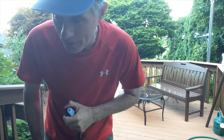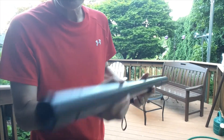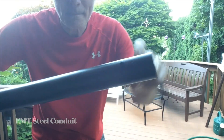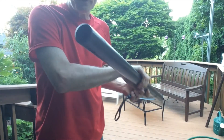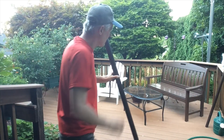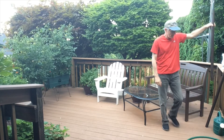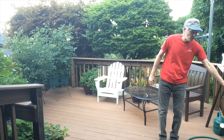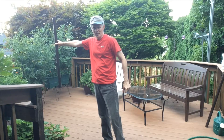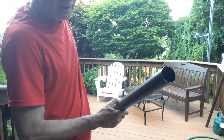After many different attempts, I decided to use this inch and a half EMT conduit. I'll drill some holes in it all the way through and attach it to the deck railing. One of them will go back here, one of them about 9 feet or so forward, and two more into the back corner of the far side of the railing. That'll give me the four posts to hang it lengthwise.